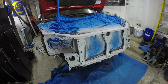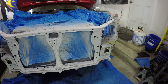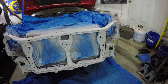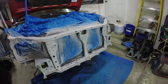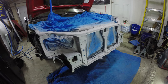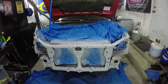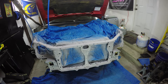And there it is with two thick coats of that rust check primer. It is awesome stuff — it just sinks in really well. I do recommend using it if you can get your hands on it. The next step is to pretty much paint it, but I'm going to give it overnight at least. The rust check calls for 24 hours and I think 16 is probably good enough. Let this primer get nice and hard and make the paint really stick to it well.